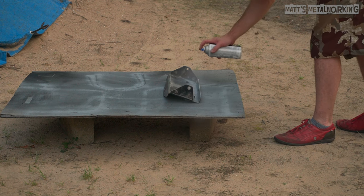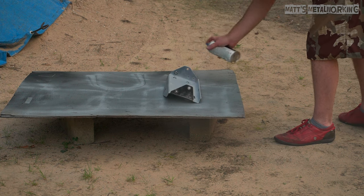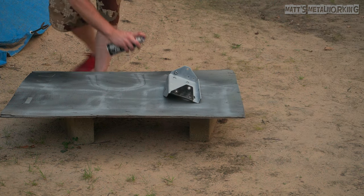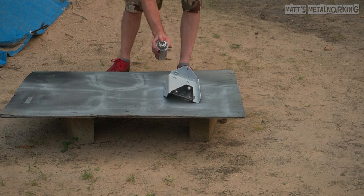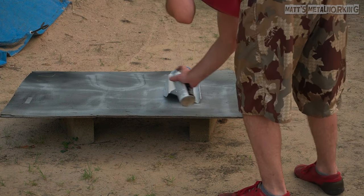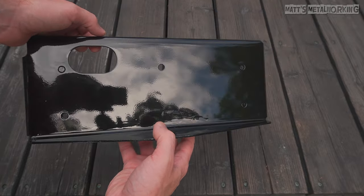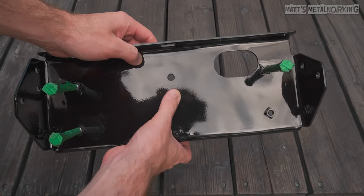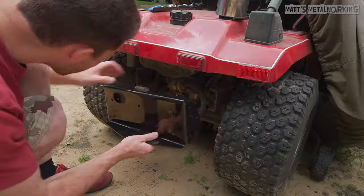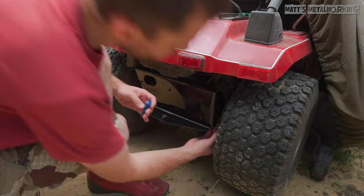After that, the piece was prepped for paint — degreasing, sanding, and then primer was applied. The primer was sanded before paint and no filler was applied here. How much time you invest on something like this will depend on the final finish. You can see some deformation at the bottom — this wasn't from holes that I patched but rather some damage from the previous owner, I'm assuming from a hitch. After that it was putting the plate back in place and then installing the bagger bracket.